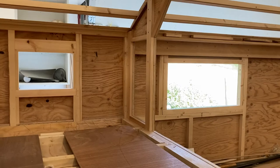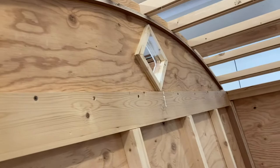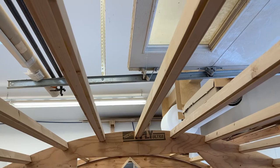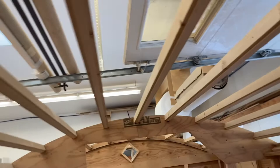I'm waiting for my primer to dry. I filled in a few framing pieces for my paneling to land on, as well as that piece at the top under the arch. I've got my furring strips on all the rafters now. My insulation is square styrofoam, and when I got the paneling on I thought it was going to be a little bit tight, especially with some glue in there. I didn't want the styrofoam to create little flat spots and make it a faceted curve, so I just gave myself a little bit more room.